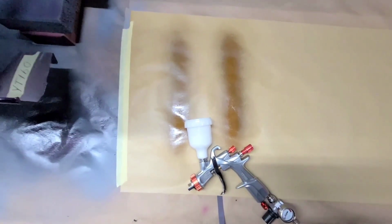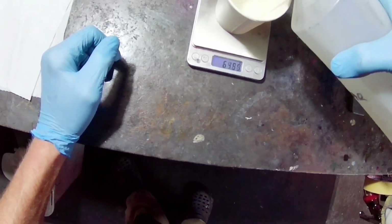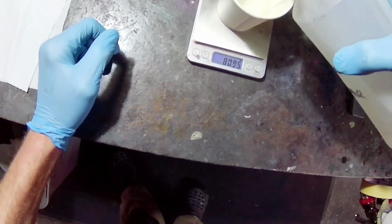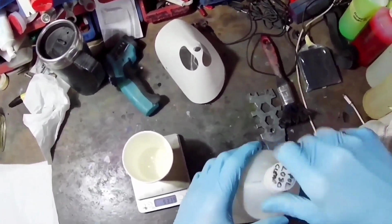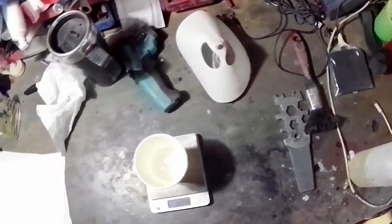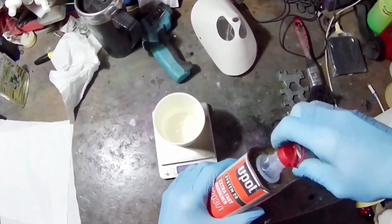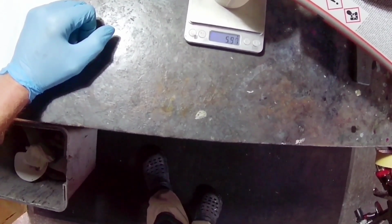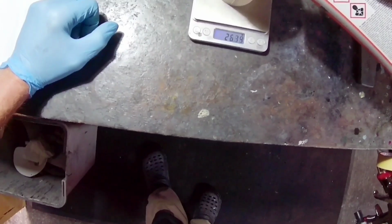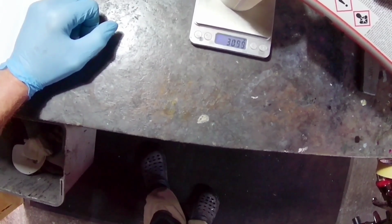I've heard people say, and people have told me, that the gun doesn't produce loads of overspray. I would question that, because to get good performance and a good finish out of these guns, you need to use them at about 2.5 bar, which is about 36 psi. Because you've bumped it up that little bit extra to get that better finish, you get much more overspray. So they defeat the object, really. You are better off getting a smaller gun and taking more time over what you do, because it will use less air and keep the overspray down, although you will be spraying for a bit longer.